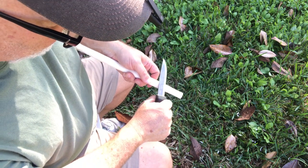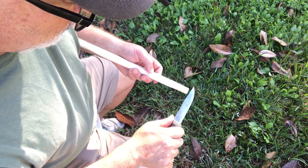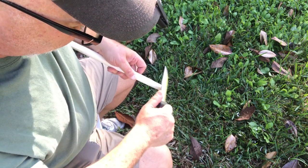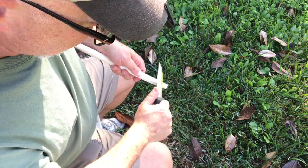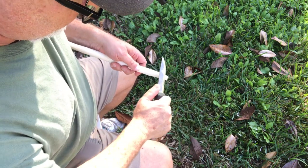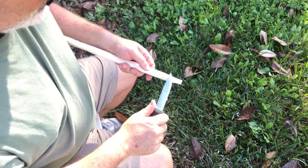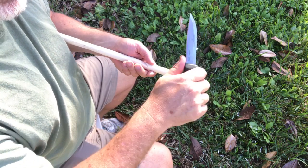After I've established how far back I want that point to start — where I want the shoulder to be — the shoulder is the transition from the flat part of the dowel down into the point. I can come back to the edge and shave off again to bring that diameter down even smaller. You can see I'm becoming more aggressive with the knife now, and if I need to, I reset, find that edge, and do it again. Fight the urge to go back and forth — keep rotating. Once you pick your direction of rotation, whether clockwise or counterclockwise, keep going with that.